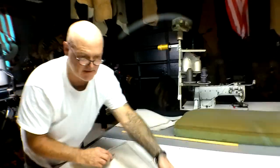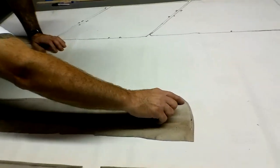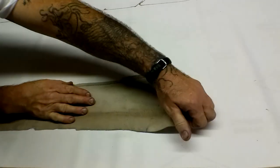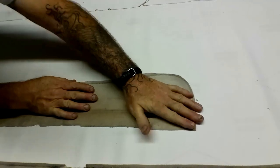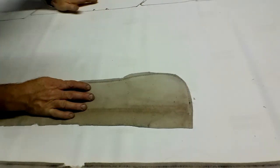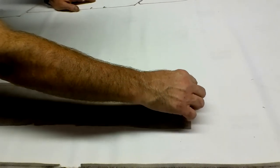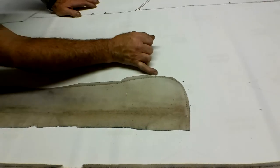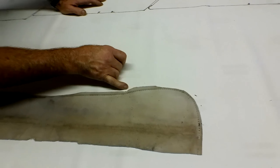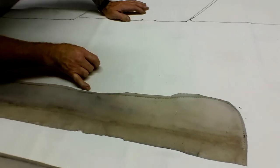This piece right here is a perfect example. This is a gusset, an outside gusset. You can see that he cut this, so you have to fix that. And this shrinks a little bit. Even though it looks good, it probably shrunk 3/8 of an inch maybe, or at least 2/8. So you come up and you square it and you make your corner round with your eye, but don't exceed a half of an inch. And then if it comes up, there's a half inch. Well, lo and behold, we'll just ride it and follow that half inch down